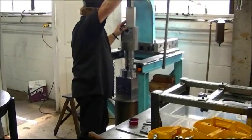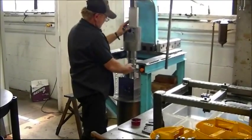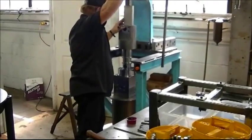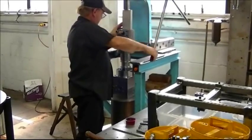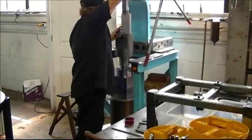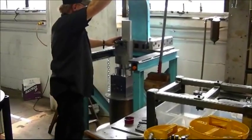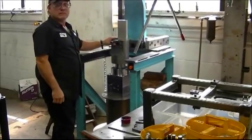Greg is now pressing the spool into the housing. He has evenly placed the spool on the appropriate end of the housing — check your drawing to ensure you are putting the head end of the spool in correctly on the correct side. As you press the spool in, balance the head end so the spool passes each seal gently, pressing slowly so as not to mar or chip any of the seals during installation.